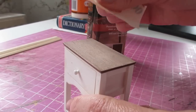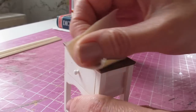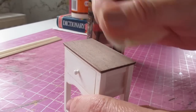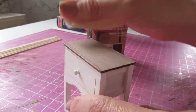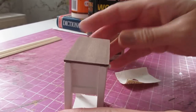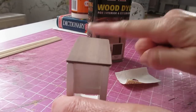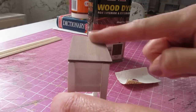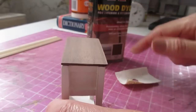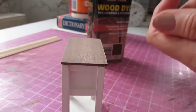And that's the thing with clamping. You want to leave them on, obviously, long enough for the glue to dry. But probably don't go away and leave things overnight, especially not if you're using clamp over tapes, you know, a masking tape, because that's going to make the marks, because you're really pressing the tape tightly onto the wood.